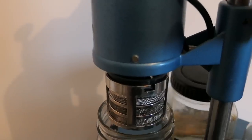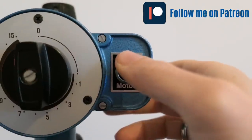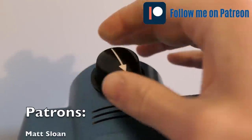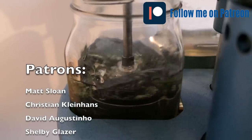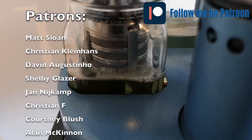The cleaning is done in several steps: first through a cleaning solution in two steps, then rinsing, and the last one is a drying phase where we dry up the parts. All the parts will then be ready to go back and be reassembled and oiled properly.